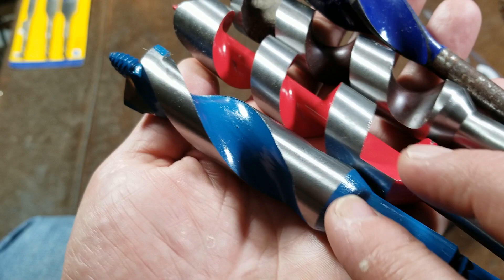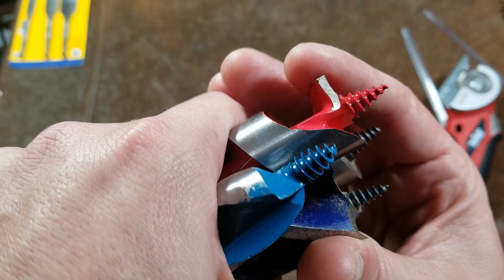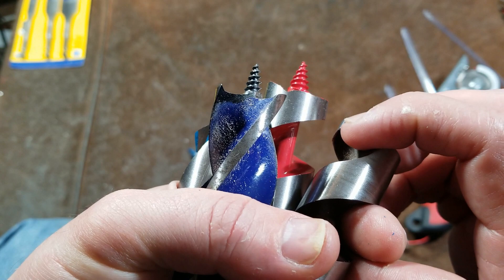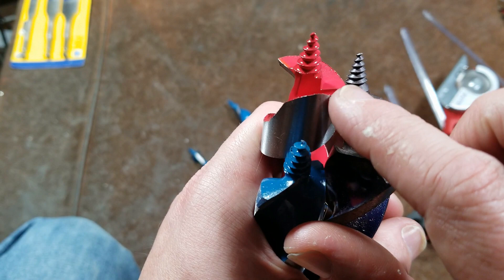The Hercules seems physically strong and won't bend, but there's actually a pretty nasty burr right on the edge. There's just not a whole lot of chip space compared to the Bauer or even the DeWalt, which have tons of room for wood chips. Looking at the tips: even though the Bauer is a single tooth, it's still strong. The DeWalt has a heavy-duty chisel design with a side cutter for reinforcement. The Irwin Speed Bore is a combination between a spade bit and a self-feeding ship auger.